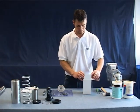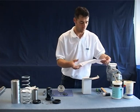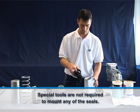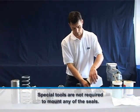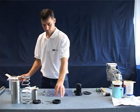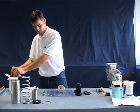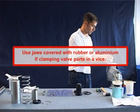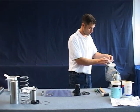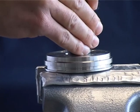The seal kit contains all seal and guide parts as well as the list of spare parts and an explanatory drawing. Remove any old seals from your work area to prevent accidentally using them. Set the guide bearings into the bottom of the cylinder still clamped in the vise. The drive spindle can be used as a mandrel to install the guide bearings.